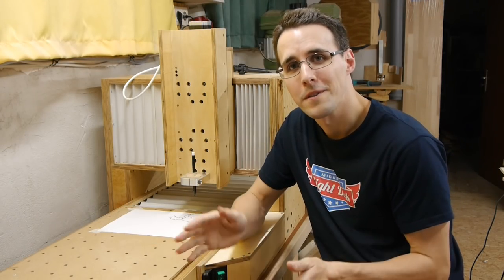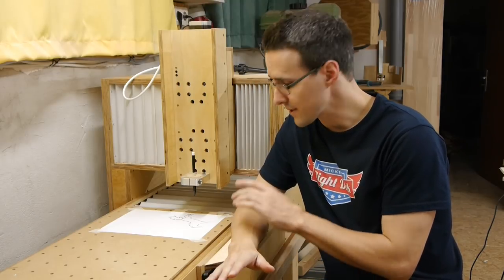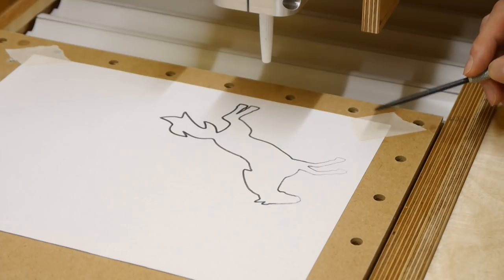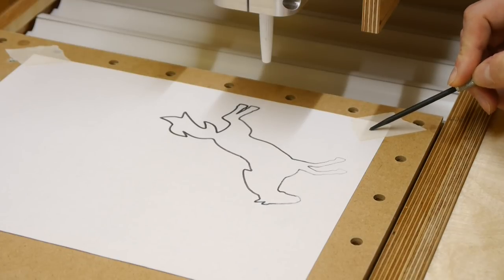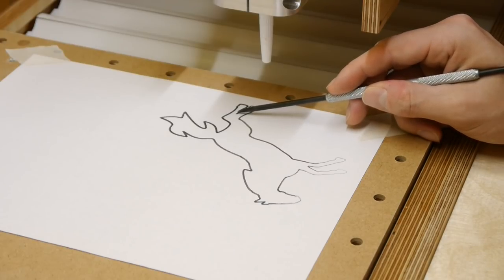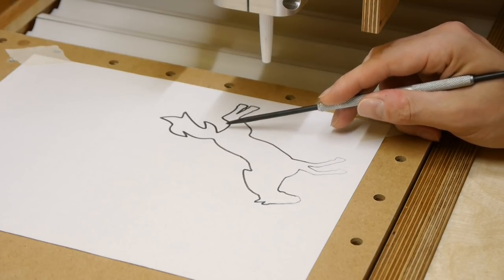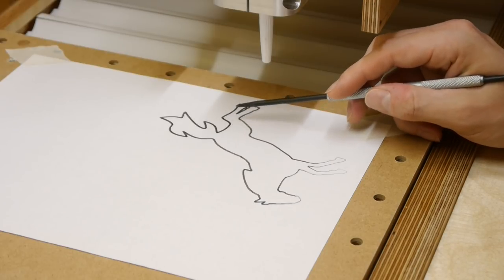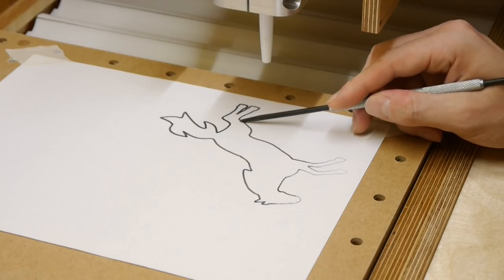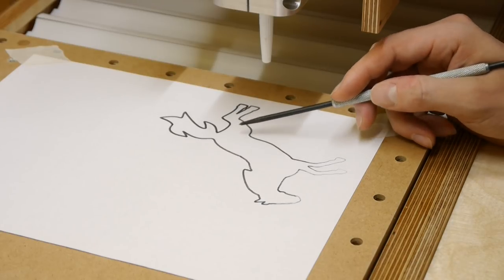So, beside all this happiness about this first result, there are some critical points in this drawing which we should go through in detail. The CNC started at this point and moved the pen over to this starting point here. And the pen made a scratching sound while it moved over the paper, and this is because the pen was pressed very hard to the surface, which could come from the Z-axis inserts in the program.